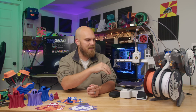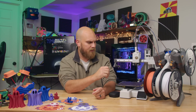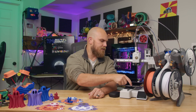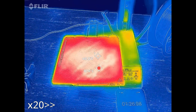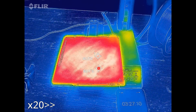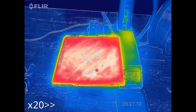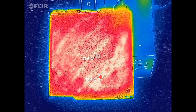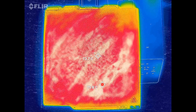The build sheet is a textured PEI build plate — that's the one that shipped with my machine. There is also a smooth PEI build plate sold separately. The textured one is double-sided and seems to work great. The build sheet can reach a maximum temperature of 80°C, and starting from room temperature, it takes just over six minutes to reach the indicated 80°C. Using my FLIR thermal camera, the surface temperature I could read was 75.5°C, though calibration may vary.